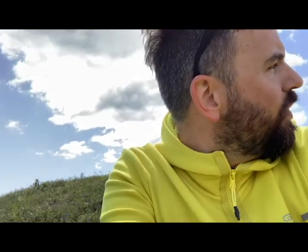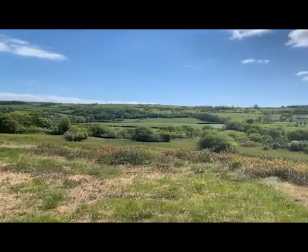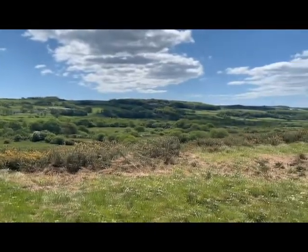survey, you don't experience the feature in the monument in the same way as you would if you were surveying it on the ground. So the actual act of getting out here with tape measures, with GPSs, with total stations, and actually identifying where a clear break of slope is, where the feature begins and ends from an anthropogenic perspective, gives you a sense and a taste of a site in a way that you never get remotely. So while remote sensing is useful and you can produce highly accurate plans from it, actually being on the ground and conducting an investigative survey is really valuable.